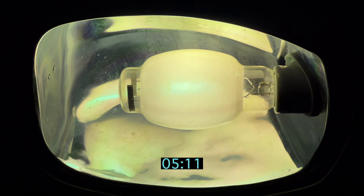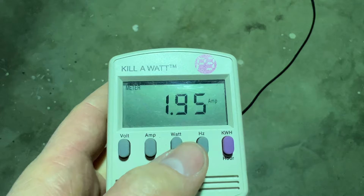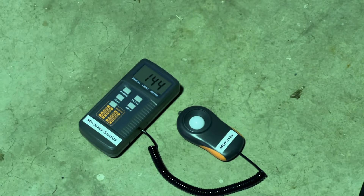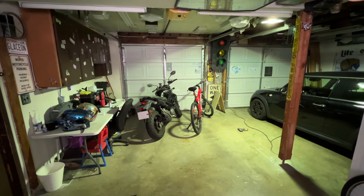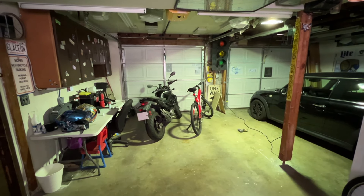Okay, I'd say we're at full brightness here — both the lux meter and the watt meter have both evened out. We're currently at 118.5 volts, 1.95 amps, 231 watts, and a power factor of 0.99. Our little lux meter down here is currently stating 144 lux or so. Naturally we have some natural light coming in behind us, but for the most part we just have a pretty greened-out mercury vapor bulb.